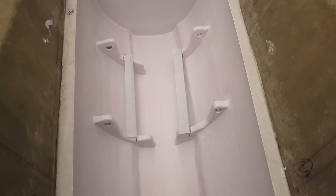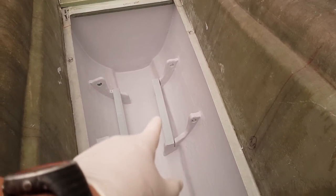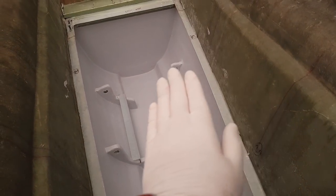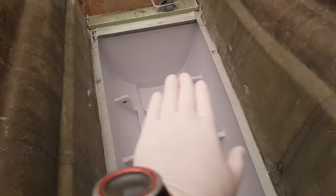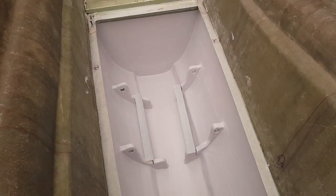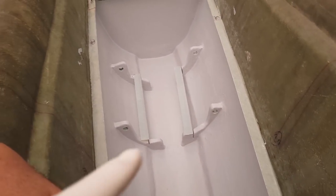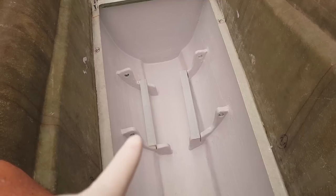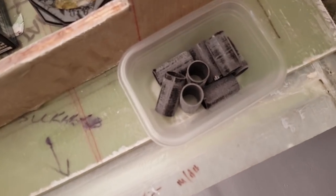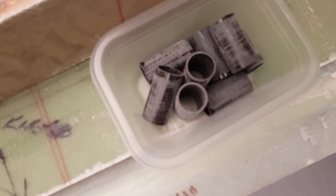I'm pretty happy with the way these came up. They're not dead straight — this one has to be on an angle to maintain level, almost following the line of the hull. The bottom of the tank isn't straight either — it has rebates designed to fit down deep into the hull of a powerboat. Anyway, it's what I've got to work with. I'm going to glass these in with some thickened epoxy and put the carbon tubes in here. I've just been sanding these up — they're all sanded and ready to accept some epoxy, and I've given them a quick wipe with acetone.